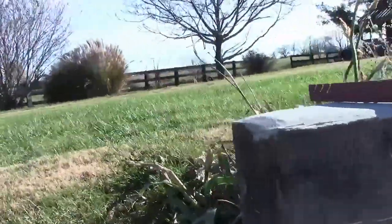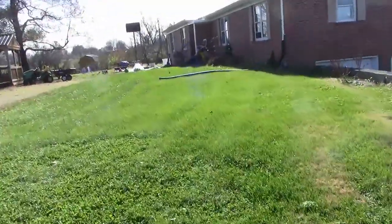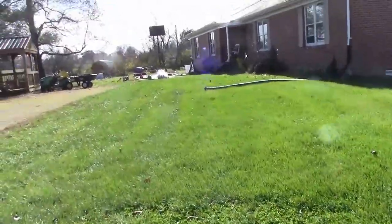As soon as you cut through the pipe, it's going to start leaking until you get it all the way cut through. Then you may have to cut it again because you won't have space to put the shark bite in. Meanwhile, the water's coming out. I've got this two-inch pump — I'm going to just pump out this cistern and do it the safe way.